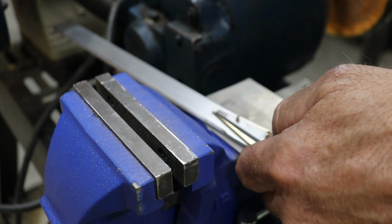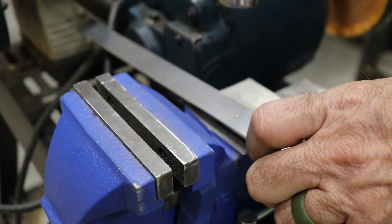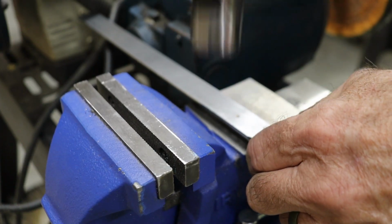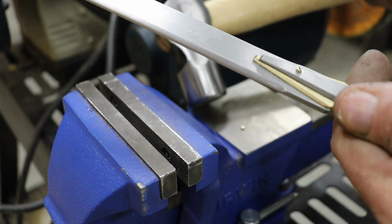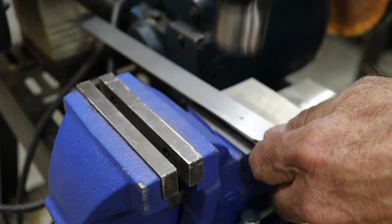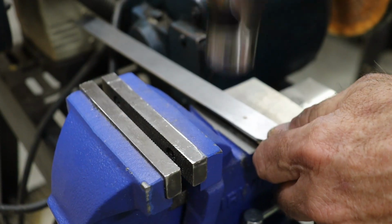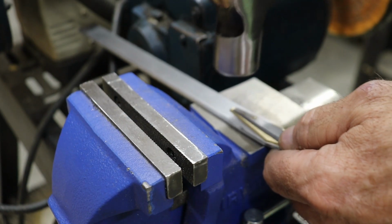Simple, strong, and look sharp against the steel. With the bolster stack lined up, I use a ball-peen hammer and a little built-in anvil on my vise to mushroom the rivet heads. Just gentle taps at first to start the spread, then firm whacks to lock everything down tight. It's kind of like blacksmithing, but on a much smaller, slightly more civilized scale.